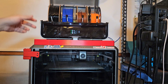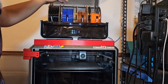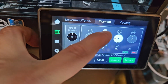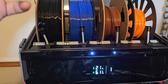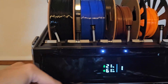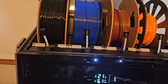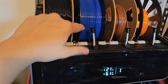But look at that — it detects it, but it does not extrude. When I push this, I can manually do it myself so that it's in there. I'm going to go to the screen, tap on filament, select my second one, and if I press 1B up there, it should redo the calibration. The CFS goes in there all the way to the buffering, and then comes back out and sticks right here. We click 1B — and this is what it does, it just retracts, it just goes backward like this.